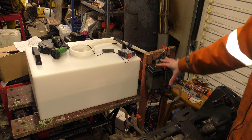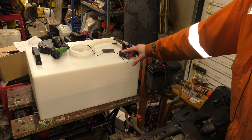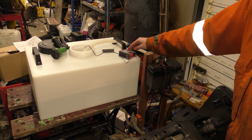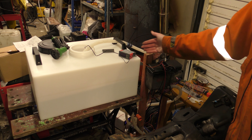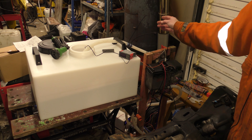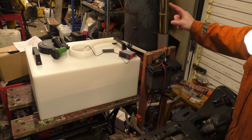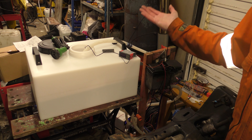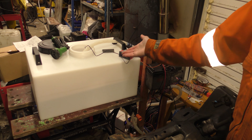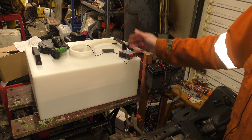This setup is just the Webasto plugged in normally, and then we have this little — well, it should be a 12-volt temperature controller, but they sent me 120 and 240 volt ones, so mine's currently connected to the mains, which is mildly dangerous. Its probe goes into the tank. I've set it to 36 degrees, so when I plug in the power supply, this'll turn on, show us the temperature, fire up the Webasto, heat it to 36 degrees, click off, and then we'll have water at 36 degrees. And we'll use the cheapest, nastiest 12-volt shower I found on eBay.